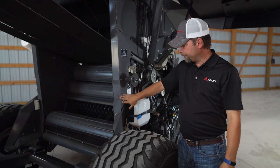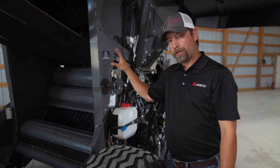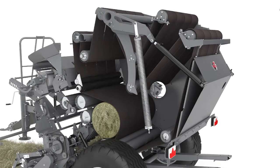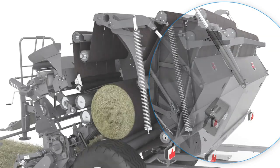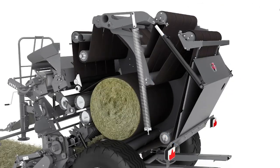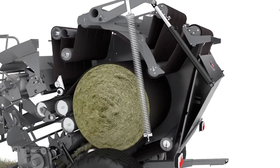When you look at the back of the baler here, you may see these circles and wonder what those circles are for. When you're actually using these balers in the field, you run the tailgate in float. The reason we run the tailgate in float is as the bale grows, that tailgate sinks down as you can see, and it moves down to keep constant tension on the springs on the side.